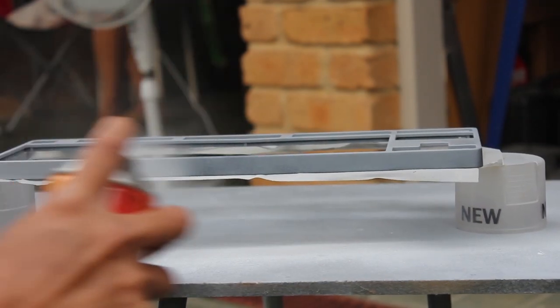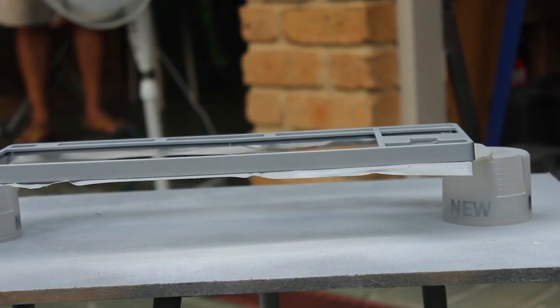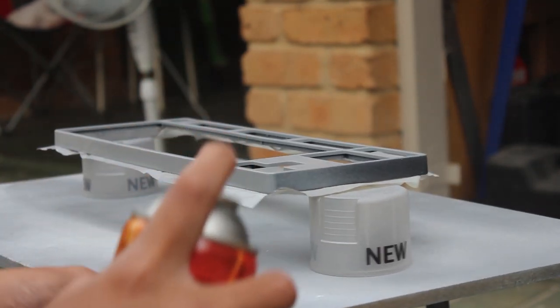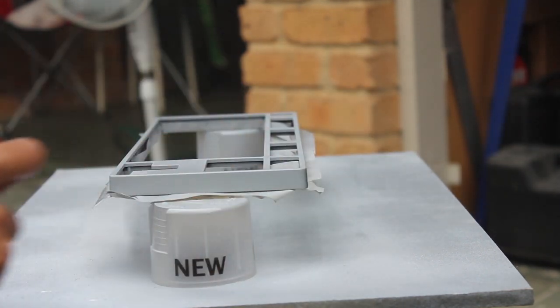After spraying those inside edges, I'll wait for about 5 minutes so it can dry a bit, and then I'll spray the rest of the shell. I don't want to go too slow since I don't want the primer to be too thick, I just want enough to fill in those scratches. Building up a very thick layer will make the job weaker.